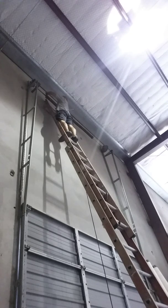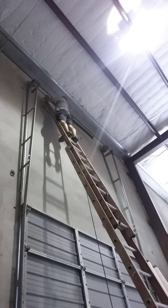You insert your winding bar and hold it, then you loosen the set screws. They're three-eighths square and they sink into the shaft right here and hold the counterbalance tension. So now I have released it from the shaft and this spring is ready to wind.